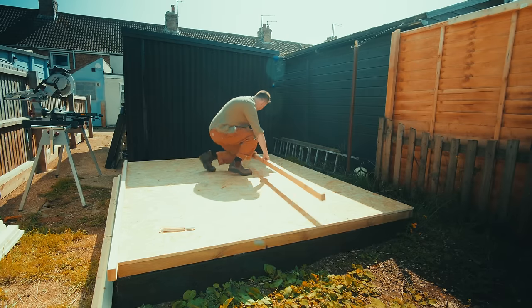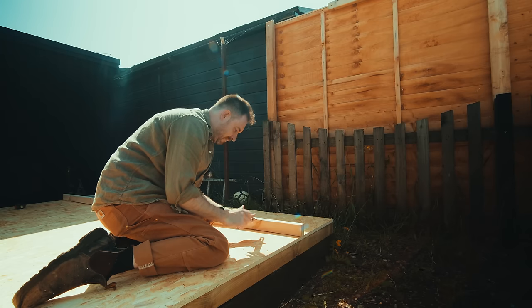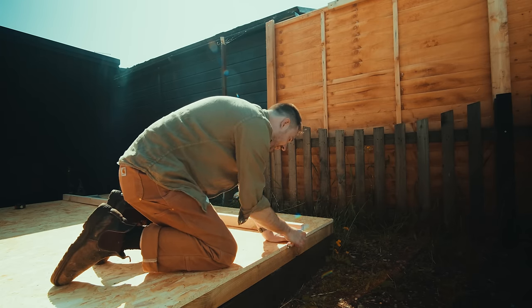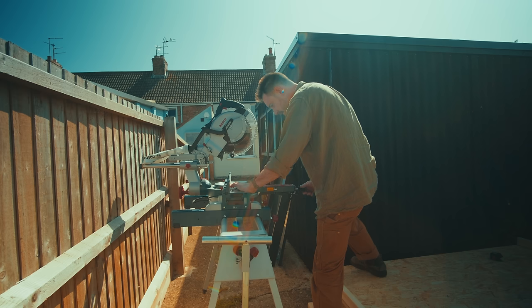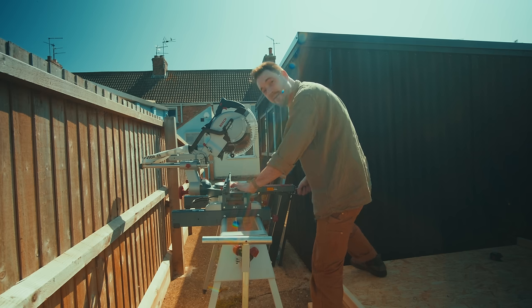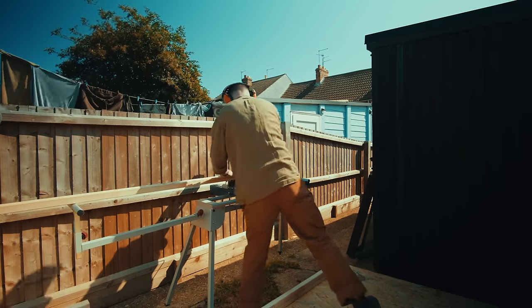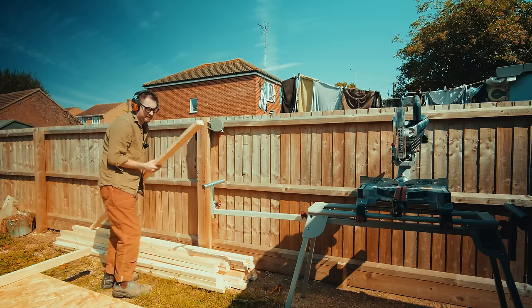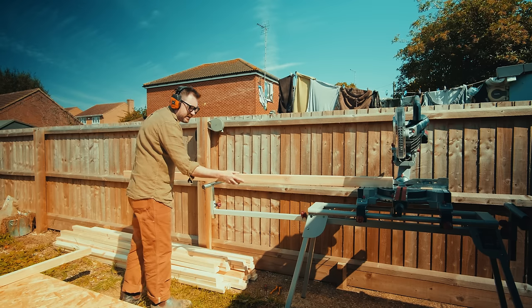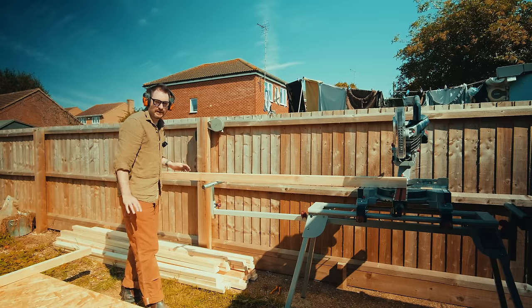I've got a bit of three-by-two that I can get onto both those marks, so this gives me the height of the roof and I can work out the pitch. I've got a bevel gauge, so I can lock that off and take it over to the mitre saw. With the angle set I can start chopping down some timbers for the uprights. I messed up the first one because I had the wood flat when I needed it on its side, but I redid it and the angle is fine. Now I'm going to cut a pile of them since I've got it all set up and I need them all at the same angle.